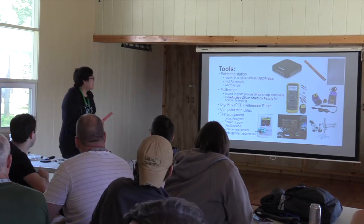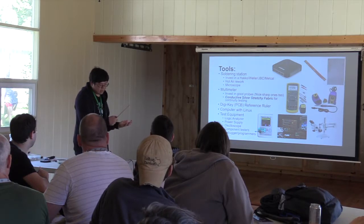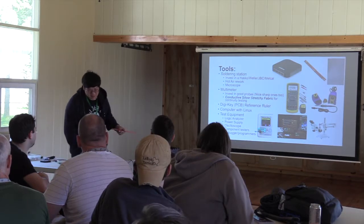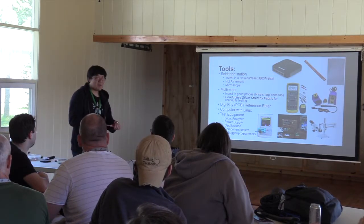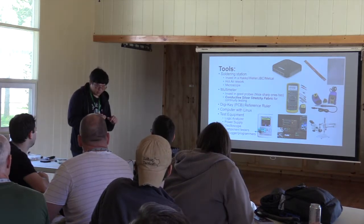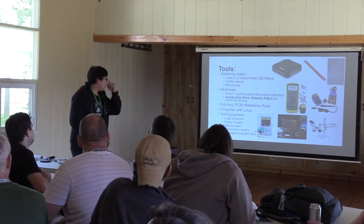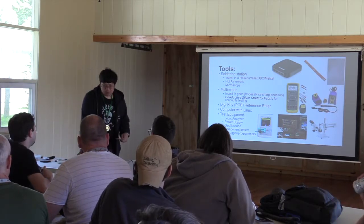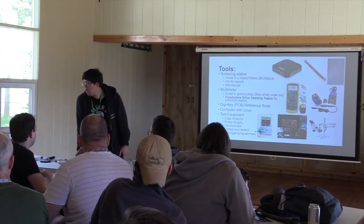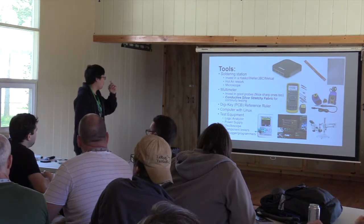And so let's say you want to find a JTAG or UART port, and it has a very small surface mount connector. Instead of tediously wiring jumper wires and having them end up breaking later, what I usually like to do, at least at work, is source the connectors, put the ruler down on the board, compare which pitch it is, and then buy a connector and some cables, and just use my debug setup and pass this around. And that also has footprints for many various components, so it's quite nice for also identifying certain surface components.